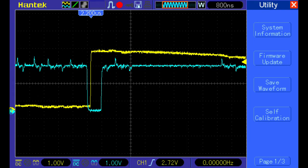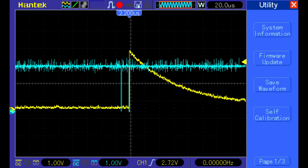So here's the output now when I'm responding to the blue I/O request, and the yellow is the data naught pin as I've turned it from input to output and then set it high. So it responds quite quickly. But here, even though at the end of the I/O request I set the data pin to input again, it remains high on the circuit because the circuit will be high impedance. And here's the same thing just over a larger time span. You can see the charge, I suppose, on the data line decaying exponentially. Also, you can see the previous I/O request, which the code ignored because that was a keyboard reader. So it was an I/O request for read, but just on a different port, FE.